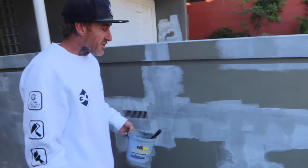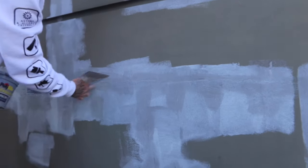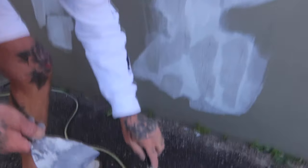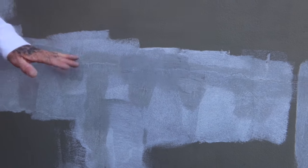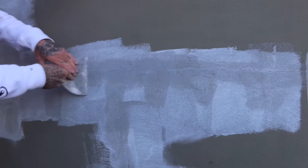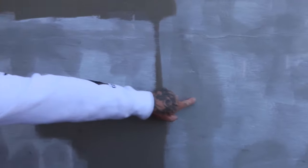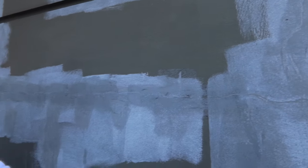What we're doing now is applying the second skim coat. I've already applied the first coat with the poly filler brick and render. You don't have to use this specific patch — any exterior patch will do the job. I've gone through, scraped it all out, and it's all been primed. I'm now putting the second skim coat over the top. This is getting the surface ready for the texture coating, so it doesn't have to be 100% perfect because the texture will cover any imperfections. If any areas are deeper than usual, apply a second coat there too so when you put the texture over it, you know it's going to be right.